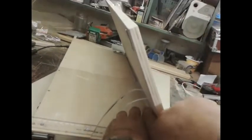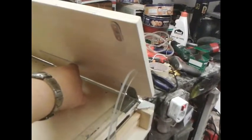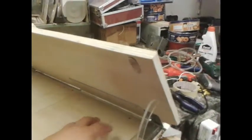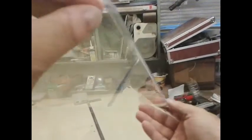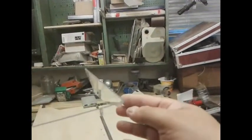Shouldn't wait that long. The longer the wire is, the more amperage you need — it probably has something to do with resistance. Trial and error, and I found out what works. This one I seem to have overheated a bit because it's too soft. Let me press pause as it'll take some time to cool. Okay, let's take it off. Now we've got a clean bend here, to whatever degree I set it. The only things that are sub-optimal are this corner and this corner — but like I said, I was talking too much and not paying attention.